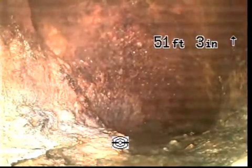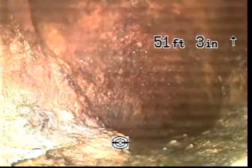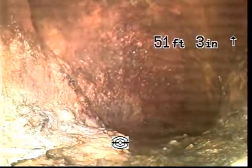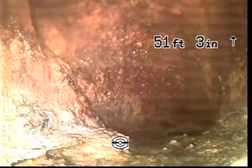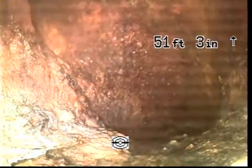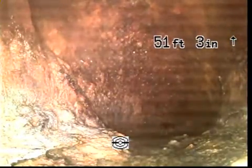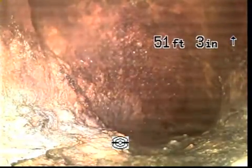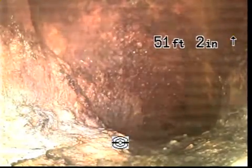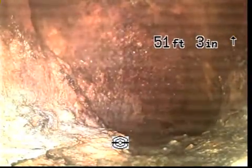But because of something that was voted years ago to renew the lateral, the contractors are doing it for the city. It's going to be done at no charge to the homeowner, but it will be renewed. Again, the time frame, I have no idea. When you use the word renewed, does that maybe mean not a new pipe? Well, they might put a liner in it. Instead of digging out the old pipe and putting new pipe in, they have the option, based on cost effectiveness, time restraints and invasiveness, to line it or replace it.